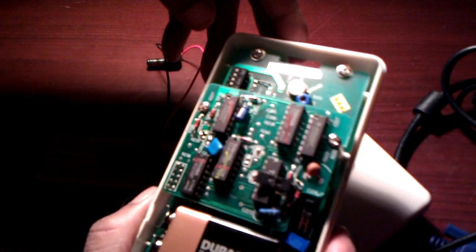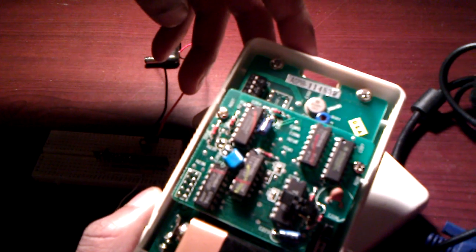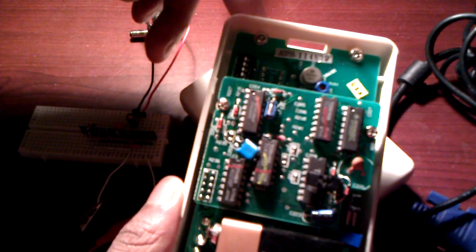Hey, hello everyone. So what we have here is actually a passive infrared sensor, or PIR sensor. So this PIR sensor, let's open it up here. As you can see, the sensor, based on this little transmitter RF circuit here, actually sends a signal out at 434 megahertz. Outside of that, it's got a dip switch which allows us to set the permutation.